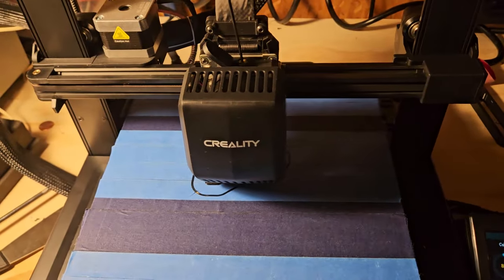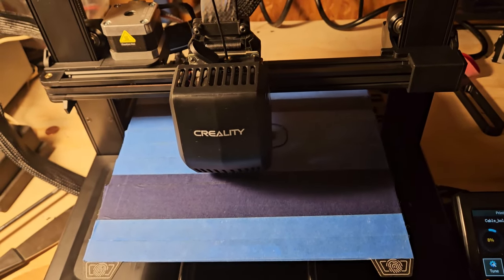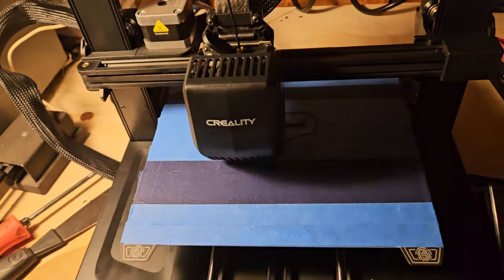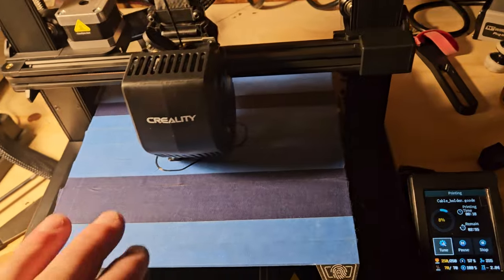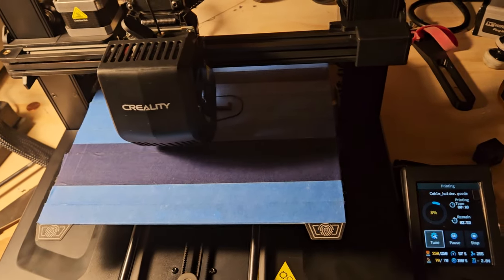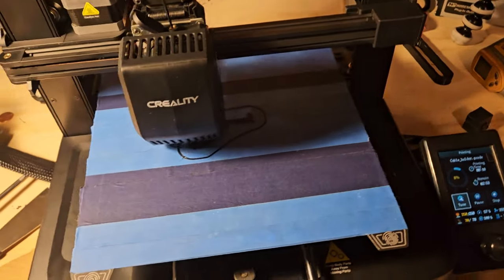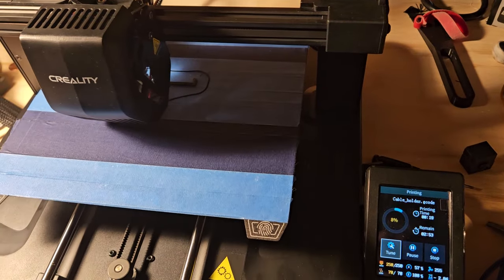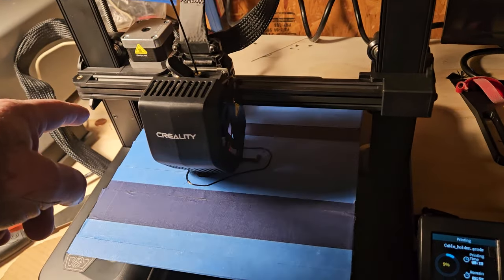Using those spacers is a good idea with this printer. Even if you drilled out the holes and put manual spinners on the bottom, you still wouldn't have an easy way to do the paper test manually — you'd basically need to run auto bed leveling each time. That takes like 10 to 20 minutes, which is the most frustrating part. If you keep screwing up and have to keep changing things, it really adds up.